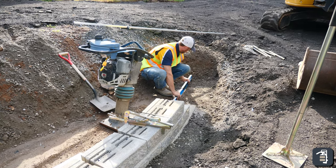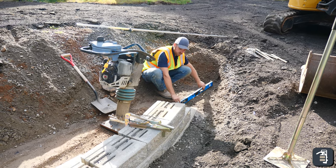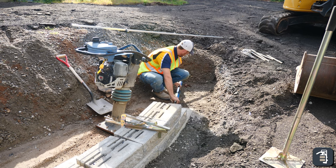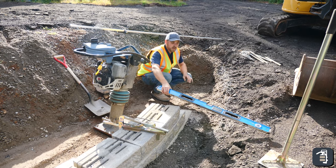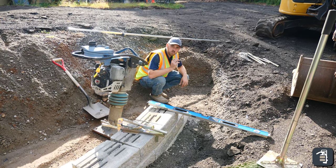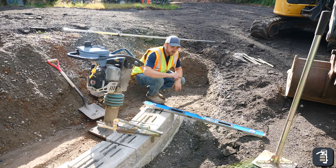Right here, we're in real good shape. You want to make sure that if you are pitching your blocks back a little bit, that you're not going back to front and front to back — you want to make sure you're parallel with the face of your wall, so making sure that this is nice and level. Sometimes you can also take our wall screed system — you can set a pipe with a laser on this side and screed off of that as well, that works awesome. For a small step-up like this, just four feet, I really don't mind just using a four-foot level and doing it by hand.